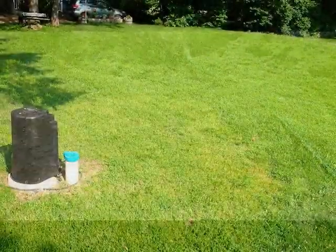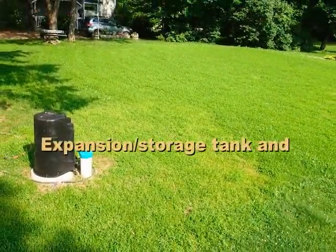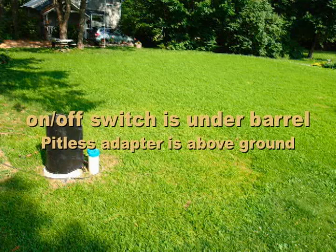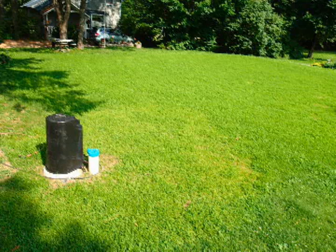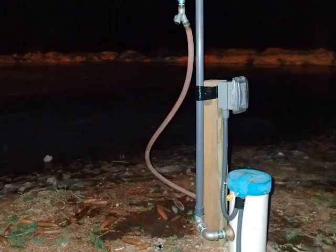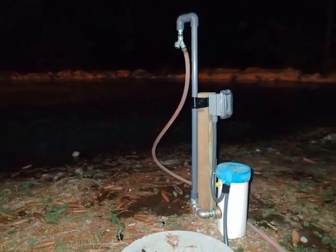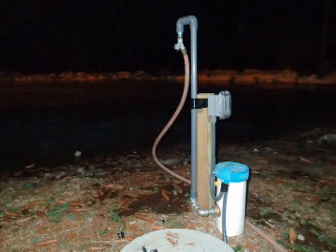This is my own well after it was completed. The well is the white pipe with the green cap on top. There is a three-quarter horsepower submersible pump in the well that feeds an expansion tank under the black barrel for summer-only operation. For winter, that expansion tank is removed, and this setup is used to flood the rink; when the power is shut off, water drains back through the pump into the well.